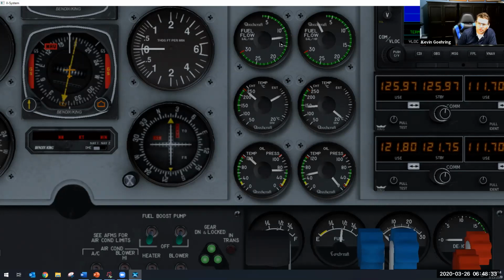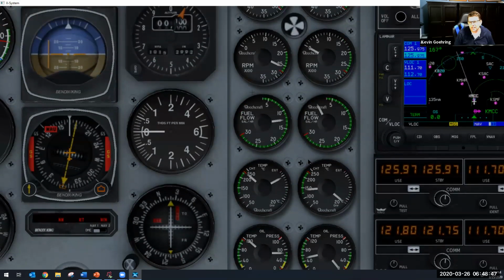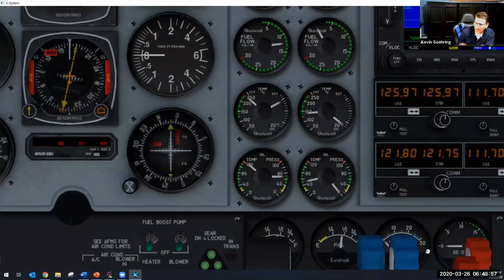And you can see when I did that, my fuel flow gauge came way down. So right now I'm running at about 12 and a half gallons per hour. We can take a look and see where my RPM is. RPM is at 2550, manifold pressure at 26. But right now, keep in mind, I'm running this like it's a fixed pitch prop. Or I can go rich of peak to the same spot, bring it up. Going rich, rich, rich. Okay, same spot. Oh, I overshot a little bit. So now I'm on the rich of peak side.